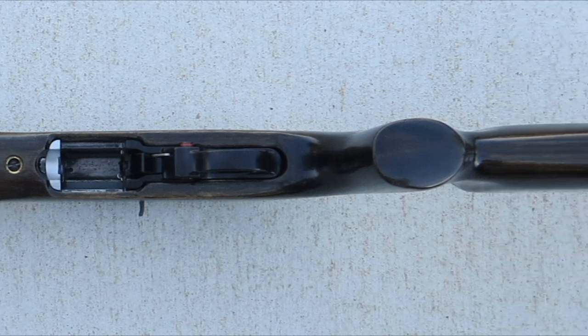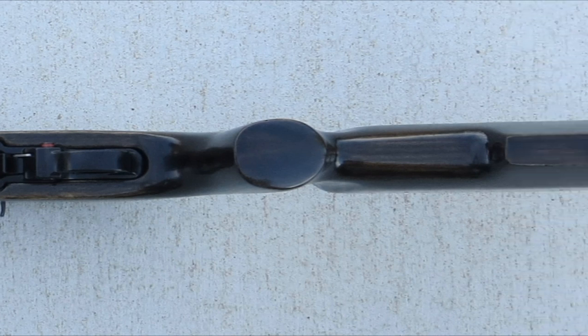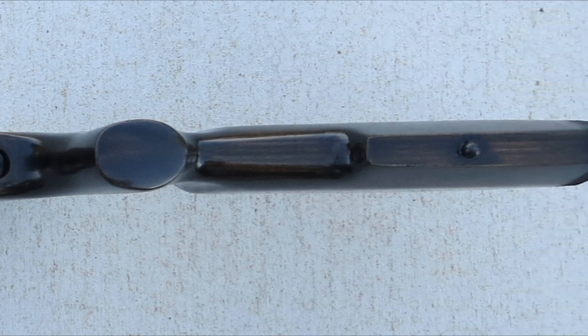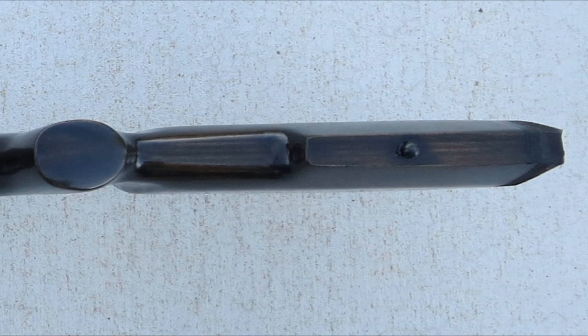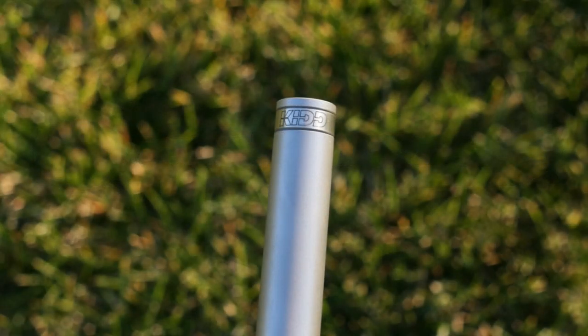You can try to cut drips off with a razor blade, sand it smooth, and then put more finish down. I was able to do that with a few of the drips, but after a while I just gave up because as I was fixing those, I'd create different drips and it became a big mess. I'm really unhappy with the finish. There's a very real possibility the stock will meet a bottle of oven cleaner to strip everything off and then get a can of black spray paint. But we'll see what happens.